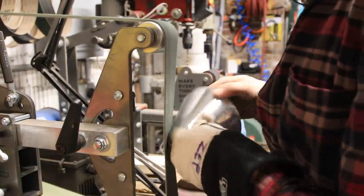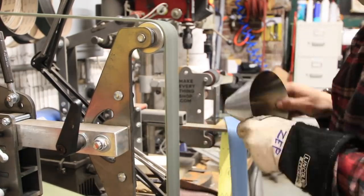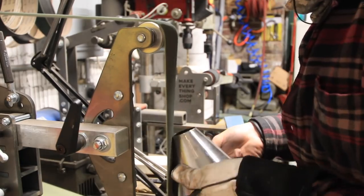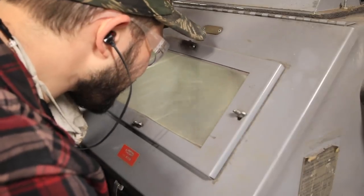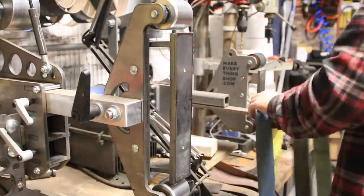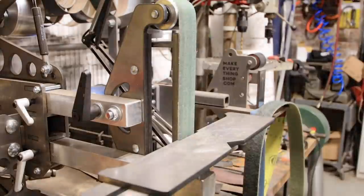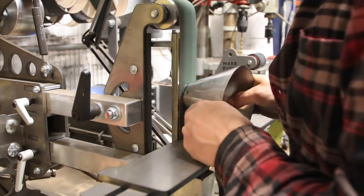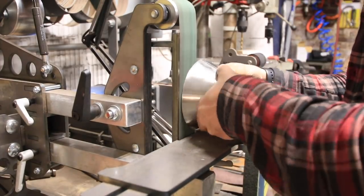Once I was done with the sanding paper I went back to a surface conditioning belt, just trying to even everything out. I'm going to wind up going through this process of grinding and cleaning up the funnel a couple times because every time I add heat I want to make sure I remove those marks. For the inside of the funnel I went over to my sand blaster and just blasted out all the heat marks and tried to remove any impurities, flux, or braze that might have gotten in there. Then I can go back and throw my flat platen back on the grinder to grind out the bottom of this cone so that when I go to braze on the bottom plate I have a nice flat surface.